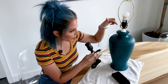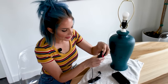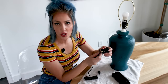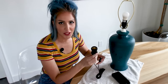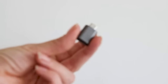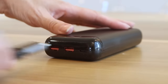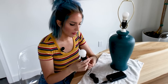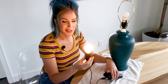The USB end is not going to fit through the existing hole, so the only way to make this socket fit would be to disassemble it, disconnect the soldered wires, pull the whole thing apart, rewire it, and then put it back together. Just for demonstration purposes, instead of taking apart the lamp I'll show you right here how it works. My power bank works better using USB-C, so I purchased a USB to USB-C adapter that just snaps on. Then all I have to do is plug into my power bank, screw in my 5 volt light bulb, and turn it on. It definitely works — for applications where you just want some accent lighting, this is going to be great.